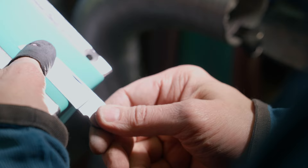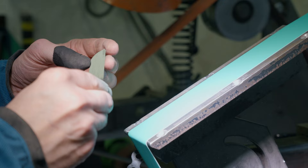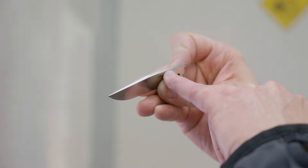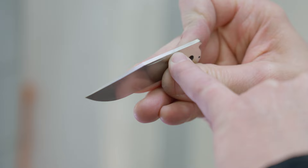The blades are at a point now where what's needed is hand finishing. Everything is finished-ground on the belt grinders. The way that I grind these blades, they are very fast to hand finish afterwards. The first thing is a little polishing — I'm going to Scotch-Brite the edges just a little bit. Even though I ground this to a high finish, there's just a little scratch here and I'm going to take that out on the buffer.